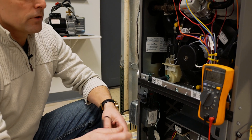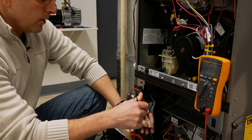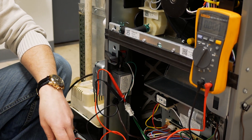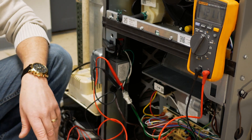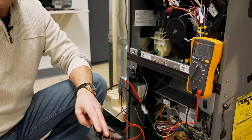We're going to go through the steps on how to troubleshoot and check the flame rectification system, starting with the voltage supply checks. In order for the furnace to work correctly, you have to have the right power supply coming in at the right voltage. We're going to take a meter, select the AC voltage scale, and check our power supply coming into the furnace between the black wire and the white wire of the plug — or wherever L1 and L2 on the board land. Once we apply power to the furnace, we get a voltage of about 121 volts AC.